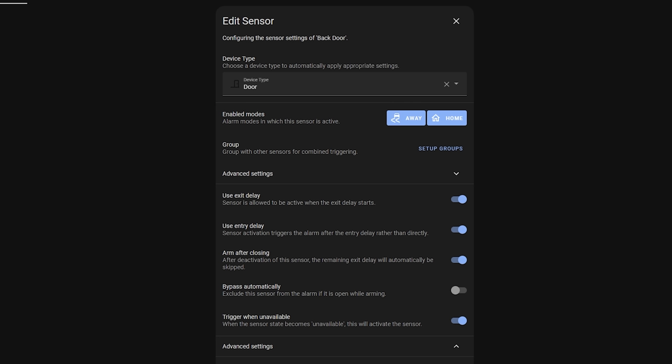Under the action section, select call service, and then in the service box, search for Alarmo, and then select the Alarmo arm service. Select your Alarmo entity from the box, and then set the mode and enter a code if you ticked that option earlier. Finally, hit save to store the automation, and you are now done.